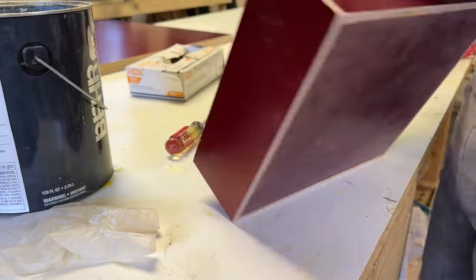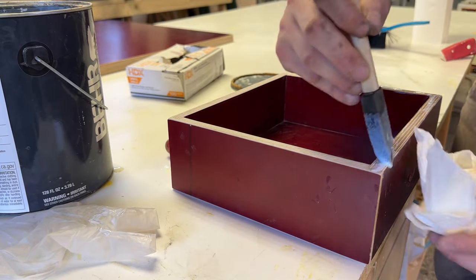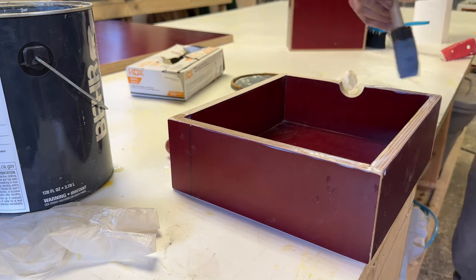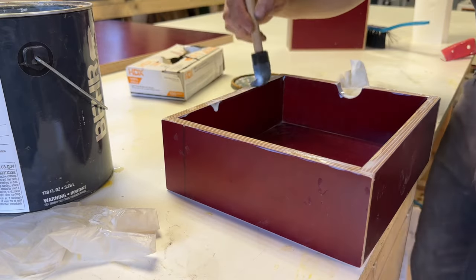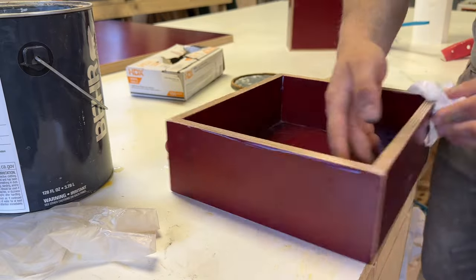After sanding I applied three coats of water-based polyurethane finish to all exposed edges using a foam brush, then came back with a dry rag to wipe off any excess. Any spots I missed with the rag were easily peeled off, and the same went for any glue — this pre-finished surface is pretty glossy and nothing really sticks to it.